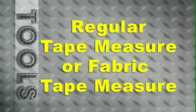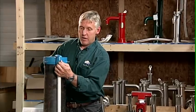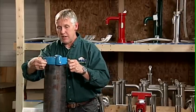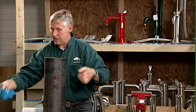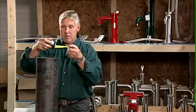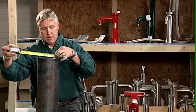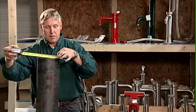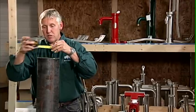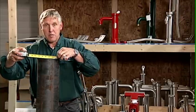I'm going to remove this cover off our display and set it aside. I'll take these screws out — unscrew the screws — and now we've opened up access to the top of the casing. We're going to take a regular tape measure, which works just fine, and measure the inside diameter of the well casing. Put one end of the tape against the inside wall of the casing, and remember that the outside edge is round, so we need to get the largest dimension in that curvature.